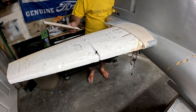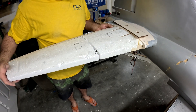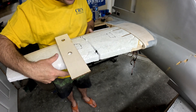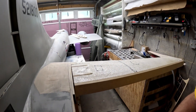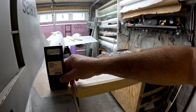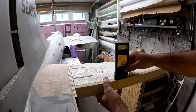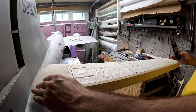The blanks are oversized and also over-length because I wanted to make sure I had plenty of material to adjust forward and aft. I want to fit this part to the tube position for a reasonably good fit between the leading edge and trailing edge pieces before trimming. I'm going to use an incidence meter — I'll place it on the stub about parallel with the trailing edge stock, which shows about one degree, then place it on the stab as well. It's bang on — right on one degree — so as long as the inclination here matches, our dihedral should be good.